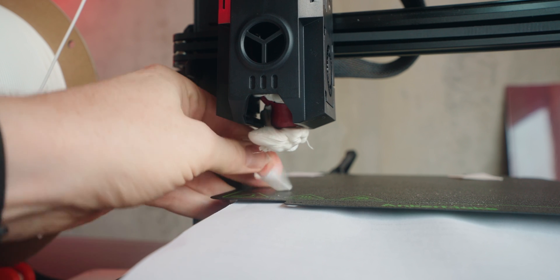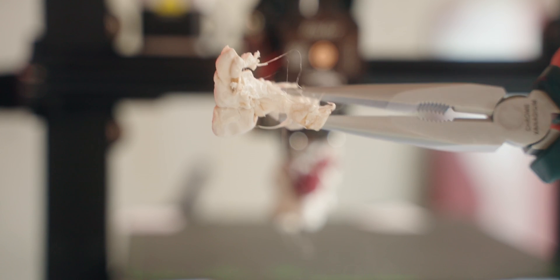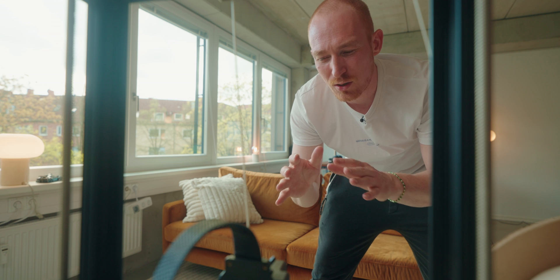For the first time we're actually going to try printing the same thing overnight and see if everything goes perfectly or horribly wrong. I just learned that if you're doing something like this the printer just keeps printing — whether everything's going perfectly or going wrong. And right now it went really wrong. The cheap filament didn't stick to the print plate, a big blob formed around the extruder and everything clogged up. The solution is to heat the printer up, get your pliers out, and with caution pick off the pieces and clean it up. I've also changed my startup G-code because the bed leveling wasn't doing as much as it should have, so now the first layer should go down a lot better.